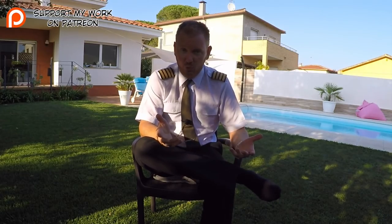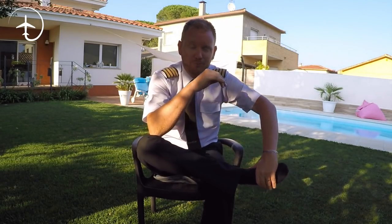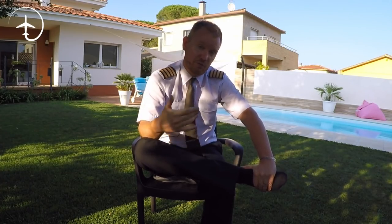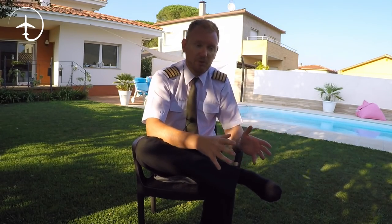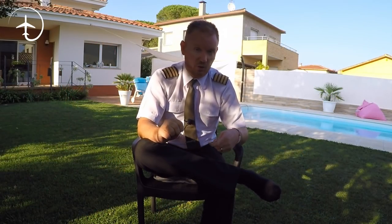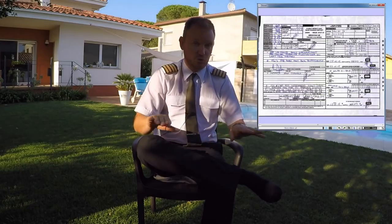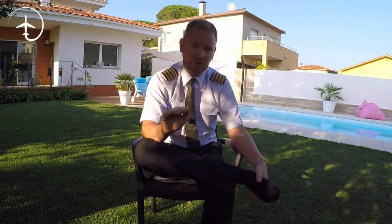What if a pilot finds damage like this when doing the walk-around? What can we do? Pilots are not in any way allowed to assess any kind of damage on an aircraft. This means that whenever we find any kind of damage — maybe a small dent, a crack, or something that's loose — the only thing we can do is inform our maintenance department. Every airline will have a specific department with engineers trained to deal with this. I will fill in the description of the damage in our maintenance log, and as soon as I fill it in, the aircraft is grounded. It's not going anywhere. Anytime I write any kind of damage into it, no matter how small, the aircraft will be grounded until an engineer can come and assess the damage.